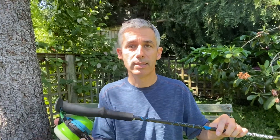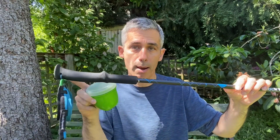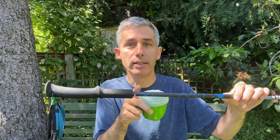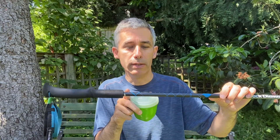After that, take the container out and add a little bit more water until it says 110 grams. Put that in, balance that, scratch the 110 mark in, and keep doing that until you have marks all the way up to 200 grams. Remember that the marks furthest from the strap — the ones that represent 100 and 110 grams — are going to be further apart than the marks for 190 and 200 grams closest to the end of the strap. So if your marks aren't all the same distance apart, you are doing it right.